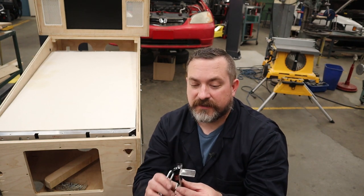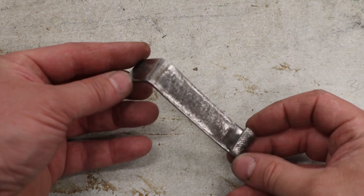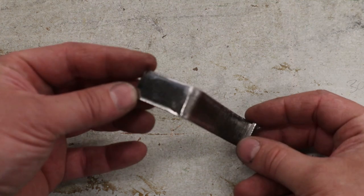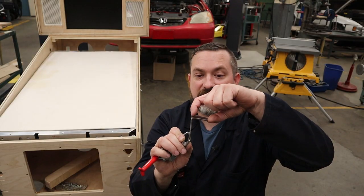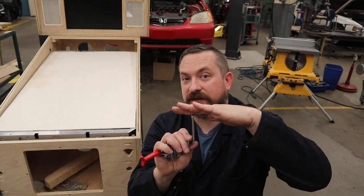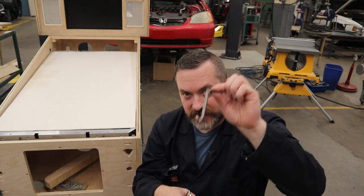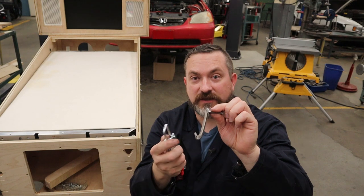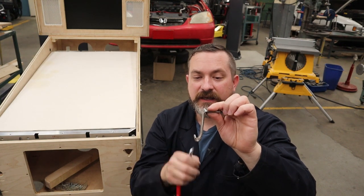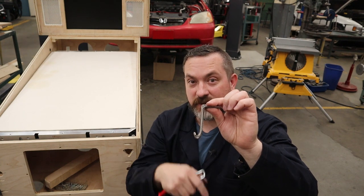just to make it suited for your cabinet. So what I ended up using is 3/4 inch wide flat bar, and it's 1/8 inch thick. And I basically have 1.5 inches for this flat section, so I have lots of space to epoxy this to the underside of the lockdown bar. And then 2.25 inches gives me enough far down to clear the TV so that this toggle clamp isn't going to be interfering with the TV. And then I give myself about 1 inch to be able to make this hook shape on the end. So let me show you how I made the other one.